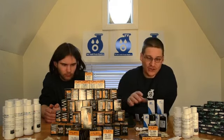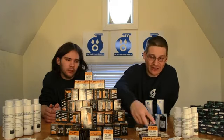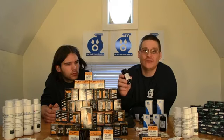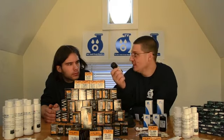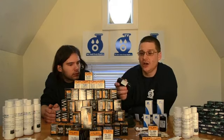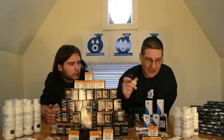Next, we also have start capacitors. In the back of your motors, depending on what kind of motor you have, you'll have a start capacitor — like Hayward Super Pumps, a lot of them use start capacitors. These capacitors go bad if you're getting a humming sound from your pump and your pump won't start. If your bearings aren't seized, chances are you need a capacitor. We have every capacitor for every pump — no matter what you need, we got that capacitor.